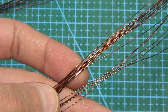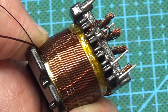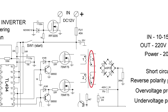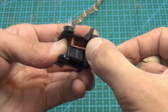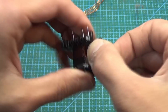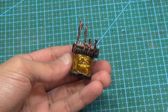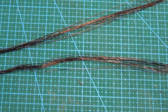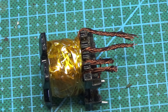There was no necessary wire at hand, so I took 0.31mm wire for both the primary and secondary windings — it won't be worse; on the contrary, the quality factor of the transformer will increase. First, the secondary winding is wound: in my case it consists of 84 turns wound with three cores of 0.31mm wire. Half of this winding — 42 turns — is wound on the bare frame, then comes insulation, and the primary is wound. Unlike the Chinese approach, I wind both parts at the same time to minimize spread. Each arm consists of 18 cores of 0.31mm wire, four turns.